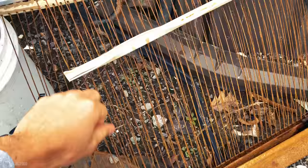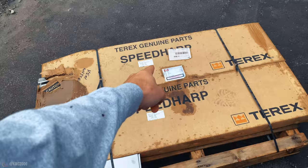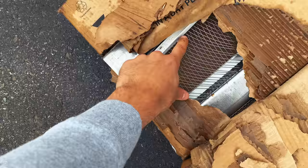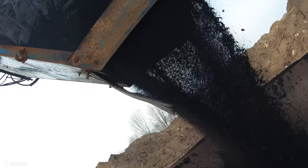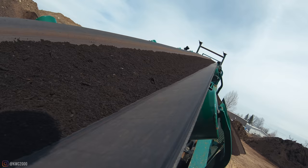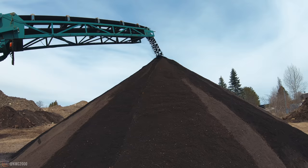Here you have our old outdated 12-mil harp strings — this is what I originally started with, but we were allowing too many pebbles to get through. So we made smaller adjustments to what I'm showing you now, which is our new set of six-millimeter screens. These will go on once the soil dries out even more — anything smaller than six mils will not pass through, giving us awesome quality soil. Everything in action here: the clean dirt passing through the eight-mil screens is shooting all the way up this 60-foot stacker into a pile that at the time of recording was 18 feet, and at the time of me talking right now is 35 feet high.